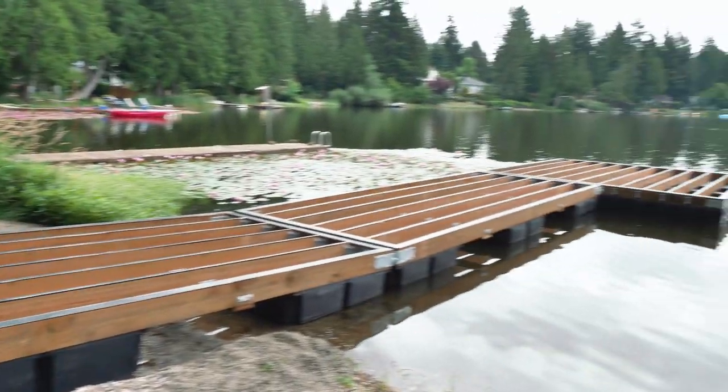All right, so we got it all floating. These docks are all built with eight-inch construction. The beams are all four by eight, and the perimeter of each dock is a four by eight square or rectangle, with two by eight joists in between. I'm not sure if the terminology is the same as a deck, but that's how I know it and that's how I'll use it. If someone wants to comment on that below, click subscribe first and then comment.